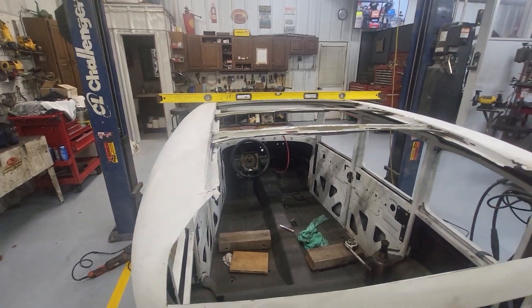This is the better of the two sides. I indexed off of a start at zero, with one-inch increments all the way down. You can see my four and five lines line up with my four and five — the key is to get both sides the same. This cutout is substantially different than that one and it's not cut as far back. But my reference lines are as they are, and I've got a little tiny bit of work to do on the back.